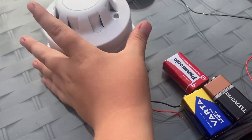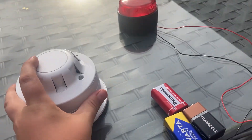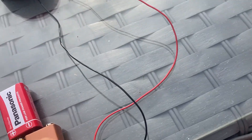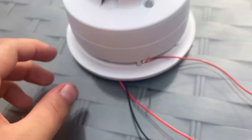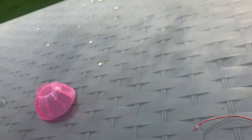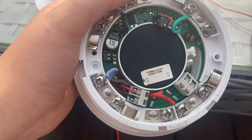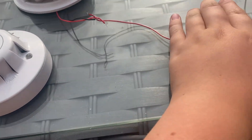And then we've got an Apollo alarm sense sounder. That's all you need. Your red one goes in there and your black one goes in there. And it's the opposite for this one. To wire this, your red one goes in there and your black one goes in there. And it needs 12 volts.